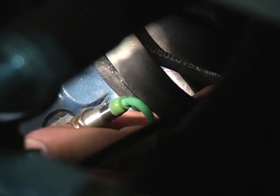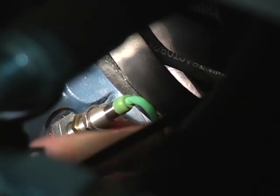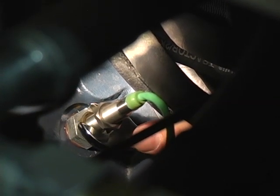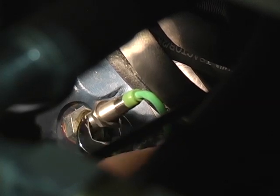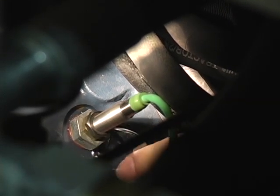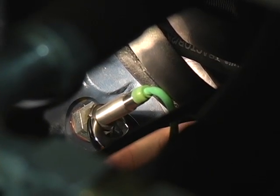Now I'm going to loosen the bottom lock nut. What I'm going to do is spin the two nuts away from each other, bringing the one on the top up and the one on the bottom down, and bring it down to the surface. I'm going to put about a quarter turn on the lock nut on the bottom so it's snugged up tight. Bring the top nut down and just gently jam those two nuts together so that the sensor doesn't spin. Looks like she's tight. Our sensor's installed. It's locked down. It's one turn away from the flywheel.